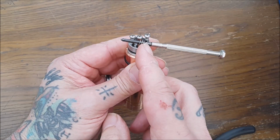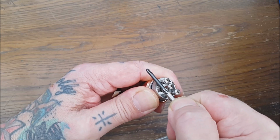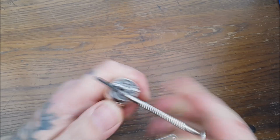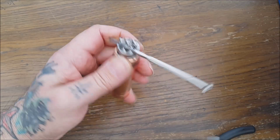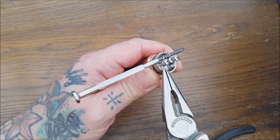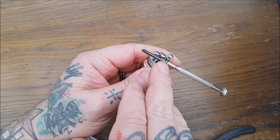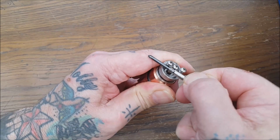We're going to use that edge of the screwdriver body to tidy that coil up. So we're going to push it up and across, up and across. Last time, up and across. And now I'm not happy with this, the way that lead's running across there, so I'm going to back that out of the way. I'm going to pull that tight again and bend it. Yeah. Now I'm going to go back in. I'm going to lift this end of the screwdriver up so that shoulder forces on that first coil to give us a bit more of a straight run through.